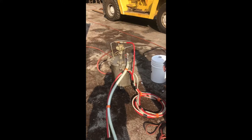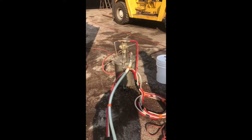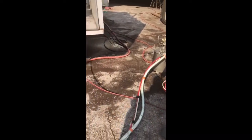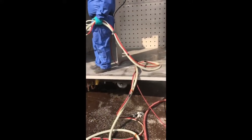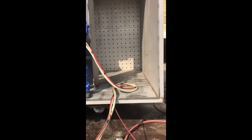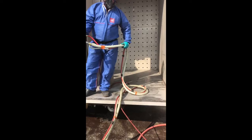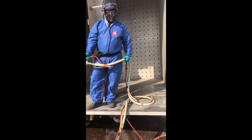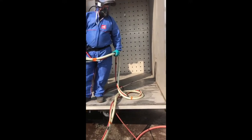This is a Lemmer five-gallon stainless steel pressure pot that we put together. Originally we started using a smaller pressure pot which only held about two liters of product. But for our larger tanks, we wanted to cut down on the refilling time. By going to the five-gallon pressure pot, we're able to put on a longer hose — upgraded to a one-inch line for feeding the product — so he gets a faster flow rate and can spray a larger area. The feed pressure is about 45 psi and the air atomization pressure is about 80 psi. He adjusts the air at the gun, giving him flexibility to produce the proper spray pattern — whether spraying a wide surface area or narrowing the fan width to concentrate on specific weld areas.